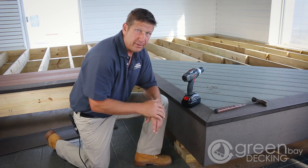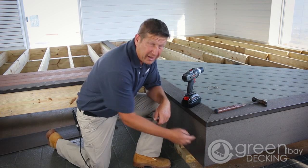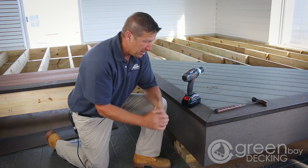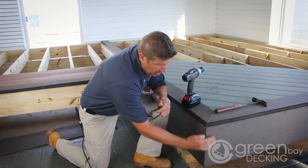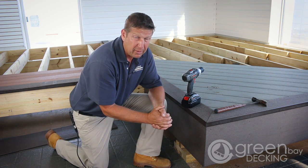I've installed the two pieces of fascia tight on the corner, as tight as I could get it. And as you can see there's a little bit of imperfection here — I'm using an existing structure in a lumber yard so it's not perfect. In order to bring this into acceptable standards, I can just hit this with a belt sander and if I do it in the direction of the grain it's going to look continuous. It's going to look real nice when I'm finished.